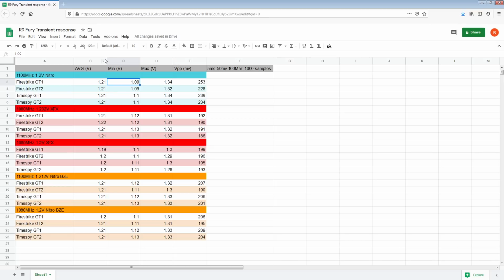But actually, if you looked at the voltages as percentages and the frequency as percentages, then it makes way more sense. Basically, if you raise the voltage by 20 millivolts on a lot of GPUs, assuming that they actually scale with voltage, which there's plenty of architectures that don't, you'll end up with like a 20 megahertz increase in frequency for a 20 millivolt increase in voltage. And that's the kind of difference that having 20 millivolts more minimum voltage is going to make, right? So that's the thing with this: a lot of the time the test results are like, there's not actually that much of a difference.